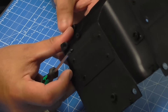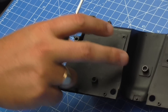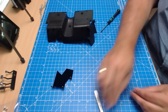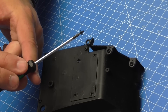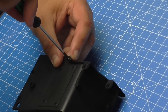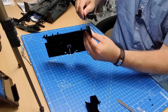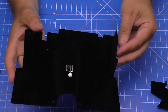Hold the right-hand side wall into place - the two at the front are going to take MP01 screws, so we'll put one in to locate it. I'm not tightening fully at the moment, I just want to get the MP01 screws to locate this. Then we're going to be putting an MP03 screw just into the back and then tighten everything up. The MP03 screw is quite short but it has got a flange on top. Now we can just tighten all these screws up completely - we're going into plastic, so even though they're going to be tight, you don't want to over-tighten them.